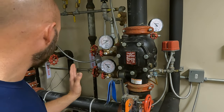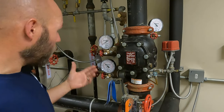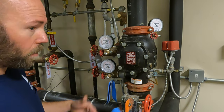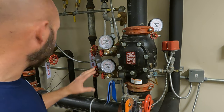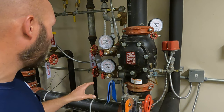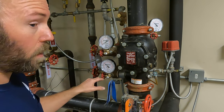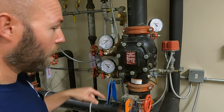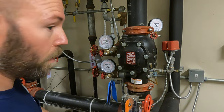Hypothetically, if I'm flowing this and I start hearing rocks come through, that would indicate an underground break somewhere where a repair was made and rocks got into the system. I want to find out about that now. If I hear them going through the main drain, that's a good time to notice the problem because we're simply throwing them out the main drain — so we know any debris is from here back to the backflow.